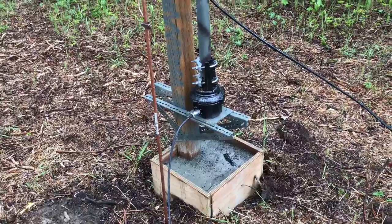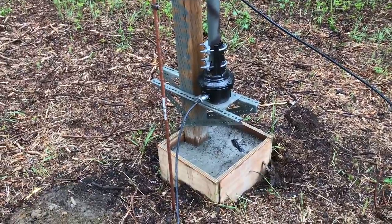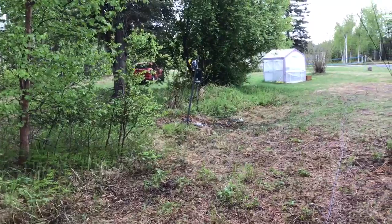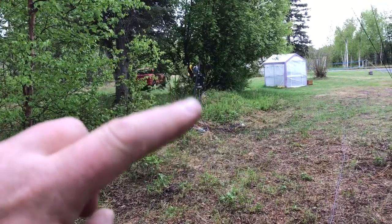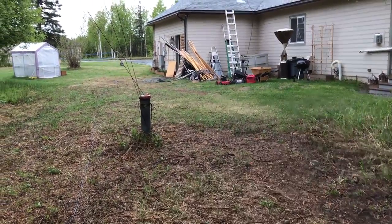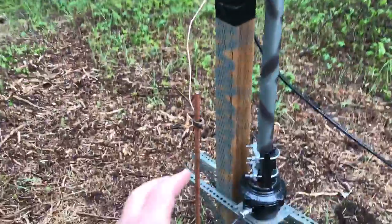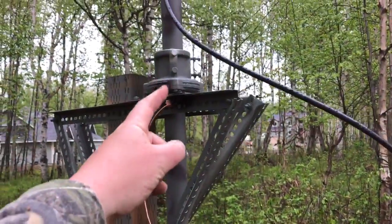It's embedded in the concrete and attached to it is a G450A Yaesu rotator. You can see the power cable — in the end that will go up around the back through a duct that runs between the property. This is actually an aerial tuning unit for my doublet, which goes across underneath the ground and pops out over there and through the house. The shack's about 100 feet away. You can see the earth rod — it's an 8 foot earth rod, with a single thick conductor kept as straight as possible and a good bonded connection to the structure and the pole.